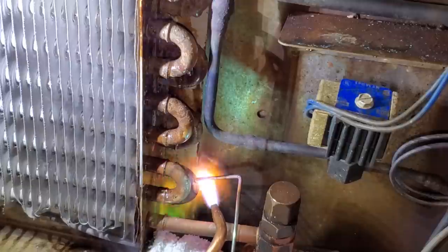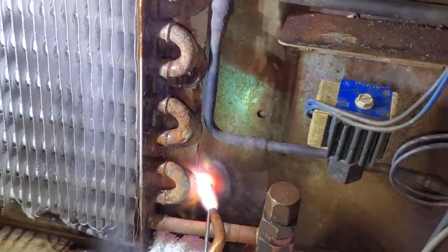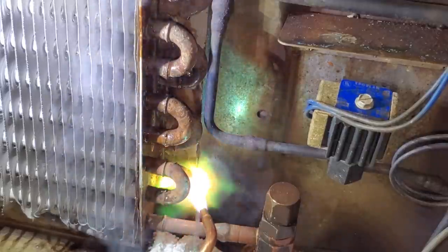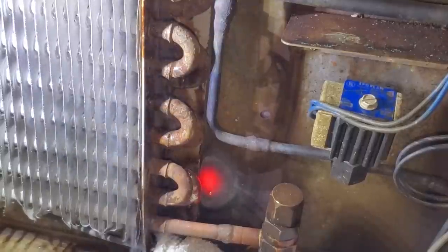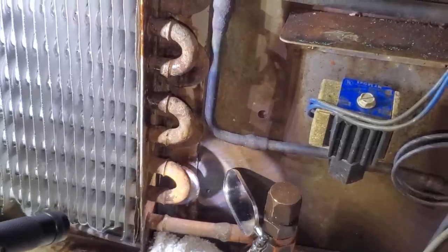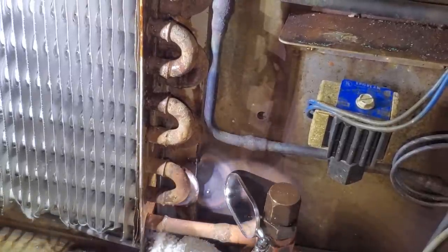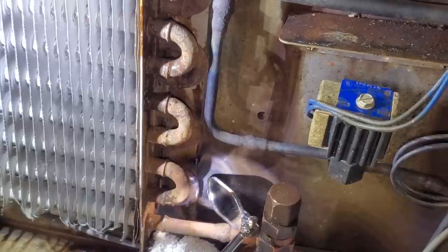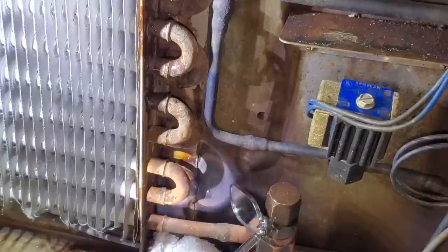I'm doing this a little different because I'm afraid about melting a hole. So I'm laying the solder on there early — kind of like I was soldering plumbing pipe. We're just going to lay it on heavy and heat it up, then investigate to make sure there's no giant hole. There's not. We have good coverage on the return bend. Looks good.